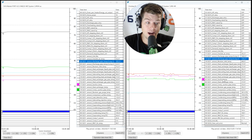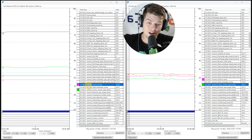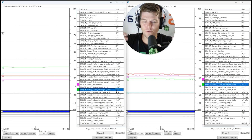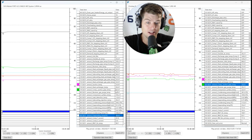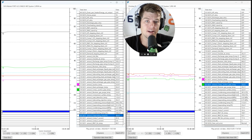Here's the live data: on VRV4, suction temp is 41°F and compressor suction pipe is 35.6°F. On VRVX, suction pipe reads 33°F but the compressor suction pipe at the inlet reads 62°F. Where is that extra heat coming from? That is hot oil being added back to the suction line — warm oil from the compression process that picks up heat and transfers it into the suction line, raising the temperature. If you took suction superheat off that 62°F reading, that's roughly 40°F of superheat, when actually the real suction superheat based on the upstream sensor at 33.8°F is pretty good.